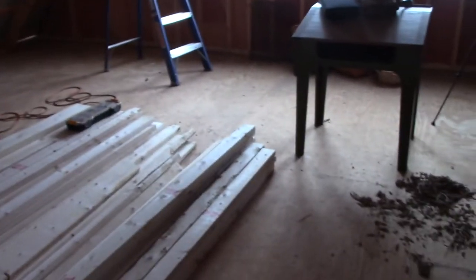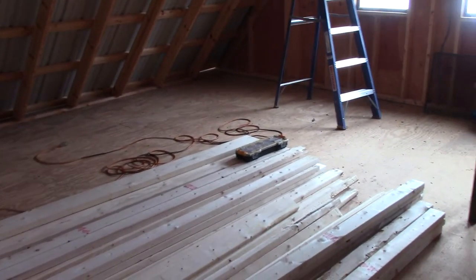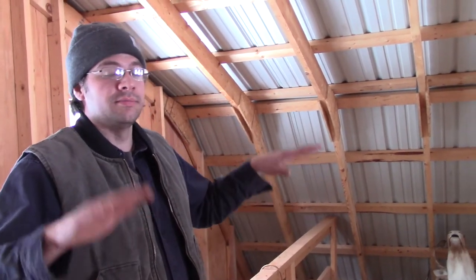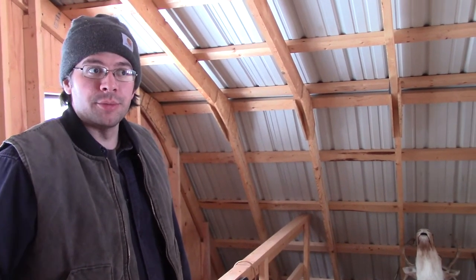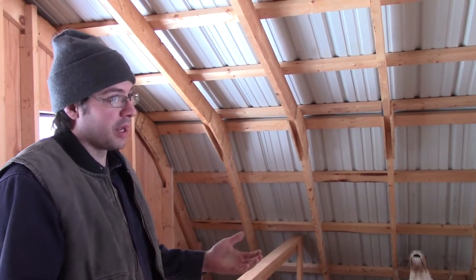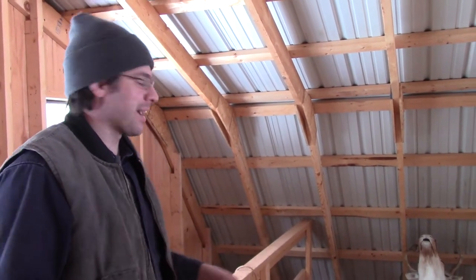I guess that means we're not doing anything by level. We're going to have to do it by number. We're going to build it in by number so that if it does move again, it all moves the same, and all the numbers are right. Otherwise, we're putting in larger material. If it moves back to what it should have been, then it's going to be crooked again. It'll never be right. You'll actually be racking the building.